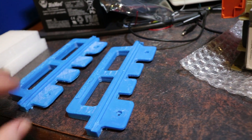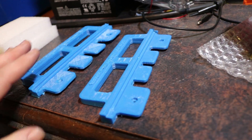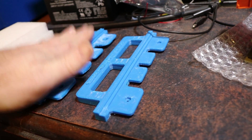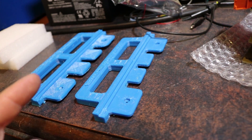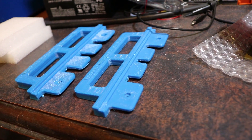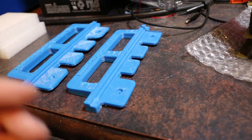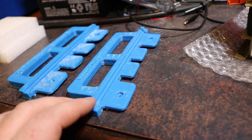What was happening is the electronics were overheating. So I've done some work to repair that and make it better. So that's just a before and after. I did modify the design - made it slightly thinner and shortened the handle a little bit, so I used a little bit less filament. After I printed this one I thought it was massive, so I'll bring it down a bit. And what I'm printing now is even smaller again - I'm just refining the design. I'm also printing in black now because I think I'm going to be pretty close to getting it right. In this print I'm doing now I've also reduced the print speed - going slower gives more time for the filament to heat up, which should help it become more sticky.